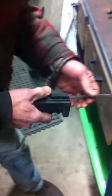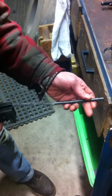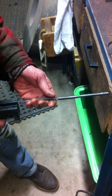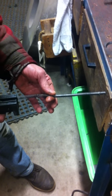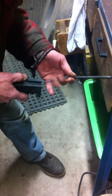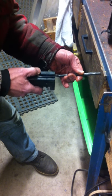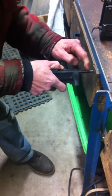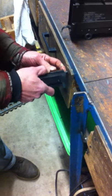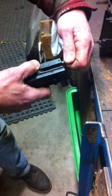When you go to put that back in the gun, put your spring back in — make sure it's going to be in position so it can lock. Grab this spring with your left hand and shove the spring onto the rod. Don't try and shove the bolt on because the spring goes sideways. Shove the spring onto the rod, then you only have a little bit left. Line those ears up, put it in, turn it, make sure it's clicked in up and down. That's safe — but still always point it the other way when working on a gun.